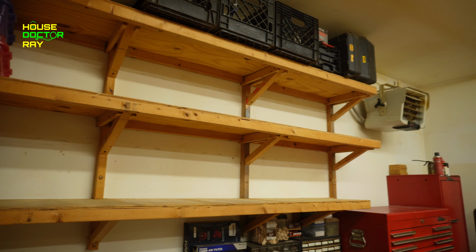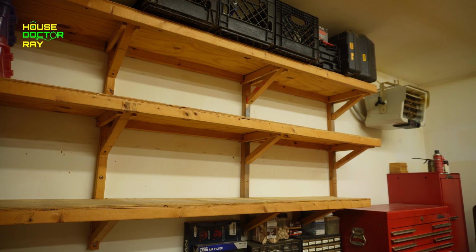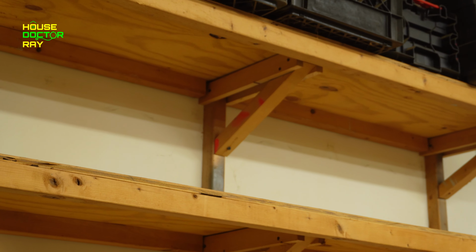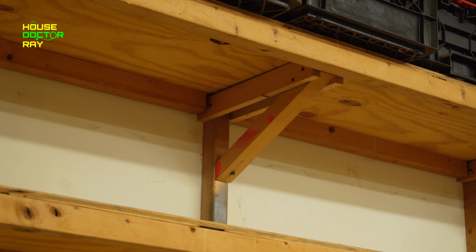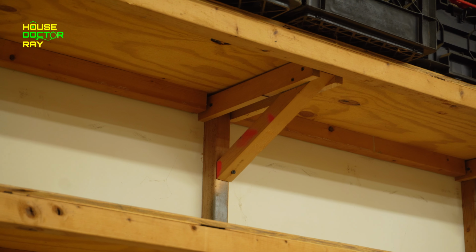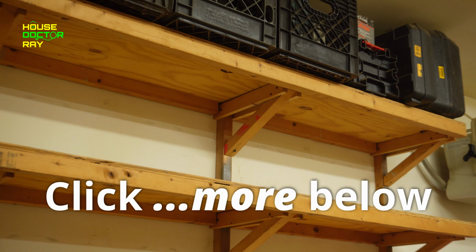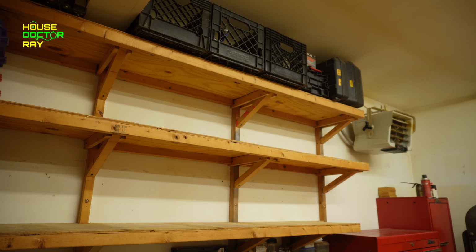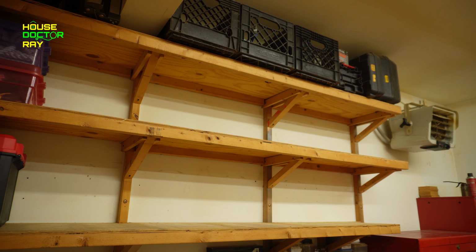These shelves here were built based on a design by Matthias Wandel. I have drywall in my garage, so I first had to screw sleeper studs to the studs behind the drywall. The rest of the supports were made from 2x4s that I ripped according to the instructions in his video. These shelves are adjustable and incredibly sturdy. I have tons of heavy things stored on these shelves, and they've never sagged. Again, I'll put a link below to the video build of these.